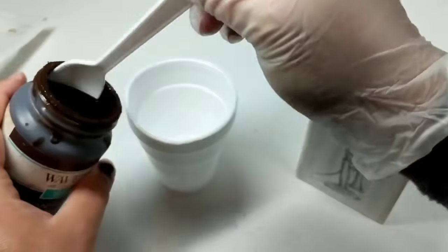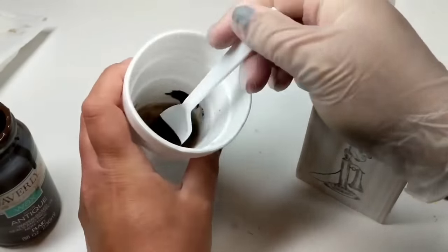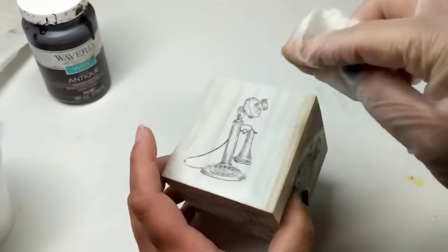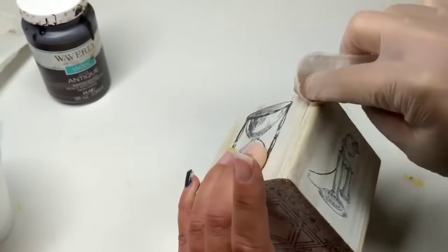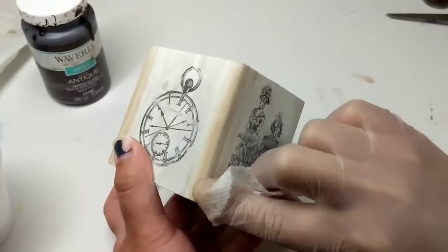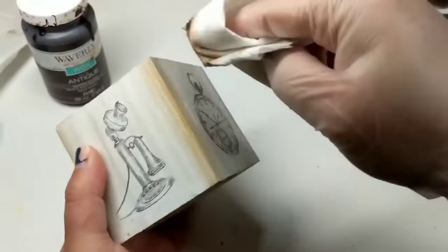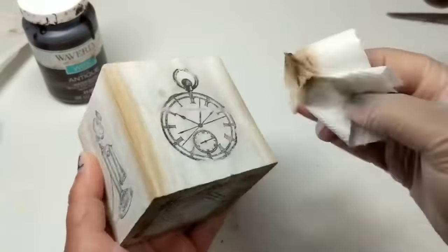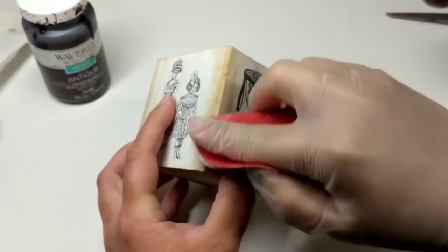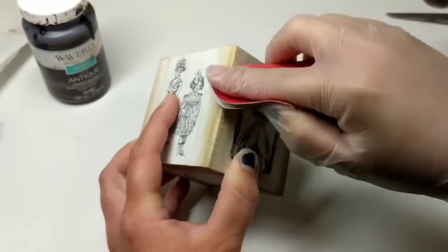However, before we throw our sealer on here, I like to add some accents. Accents are my favorite thing to do. It's the thing I like to do after it's kind of finished and you could really leave it alone the way that it is, but then you feel like you've got to take it one extra step and you can't control yourself. You've got to put something on there even if it doesn't really need it. That's my favorite part. So I put a little bit of Antique Waverly Wax in some water just to dim it down so it wasn't so dominant and dark, and give this more of a wood grain feel around the edges to really bring out that laser cut in the white and make it look very blended, and finished it up with some distressing.